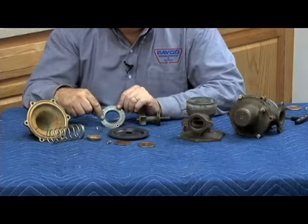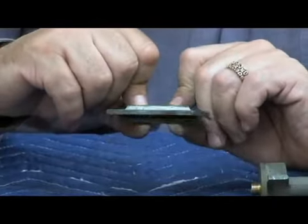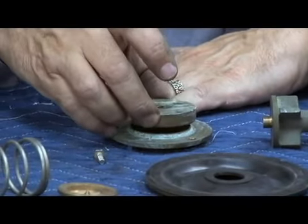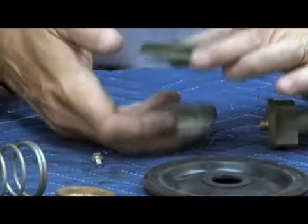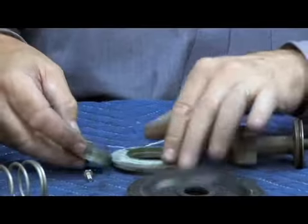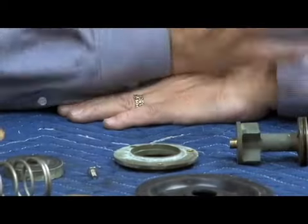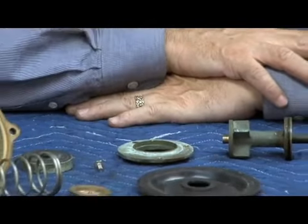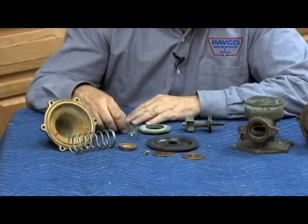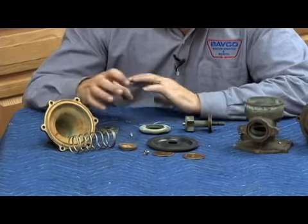Okay, first and foremost was this relief valve seat. The profile of the seat was extremely sharp. It was almost a knife-edge seat. So unfortunately what happened was a lot of times that when this relief valve disc was embedded, actually it would look more like this in life coming up, it would embed into that seat and it would not come off of the seat. In other words, the disc got embedded into the seat and they had issues with the relief valve not opening. It used to open regularly under 2 pounds. It did not open usually above 2 pounds. It would be exercised a few times and it would work fine. So the engineers were trying to figure out what's making this thing stick, if you will, so that they could replace it and fix it accordingly.